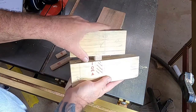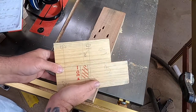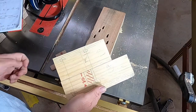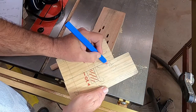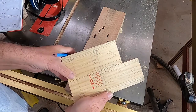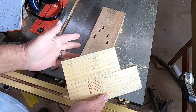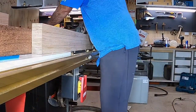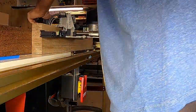Now, the great thing about these is that they are much stronger and more accurate than your standard biscuit joint, which uses a little plate. If you machine a pocket in there, you'll put a plate through here and it will do a similar job. The domino does this job better, and it's easier to make than a mortise and tenon joint. It also stops the timber from twisting and moving up and down against each other.